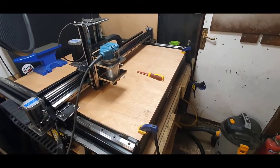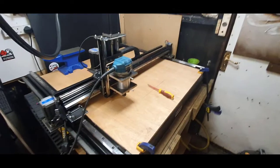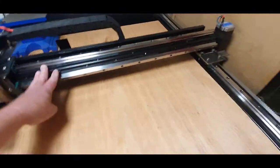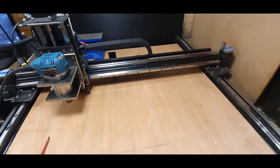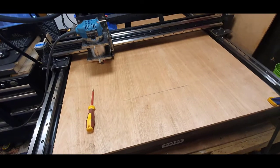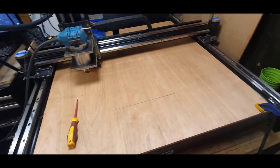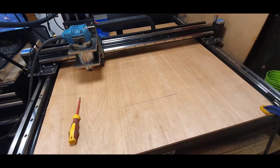Under the table is empty. I've just put some - I think it's 8mm ply - on there. The problem I've got, which you've got to be careful of, is it's just been stood up so it isn't level - hence why I've got clamps here to clamp it in and a little handle at the back to flatten it. I'm going to screw another piece on so when we cut through we're not damaging the board. I think it's about nine quid - it'll last me about three months then I'll just change it out when it curls.